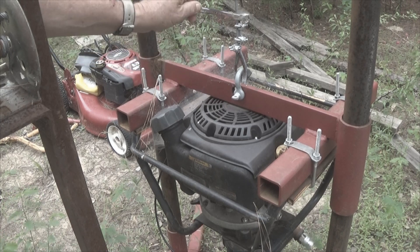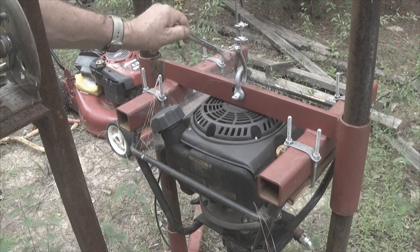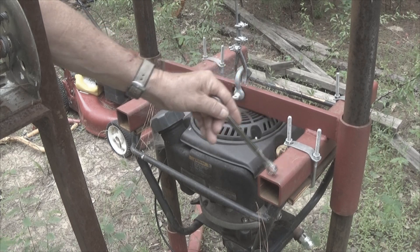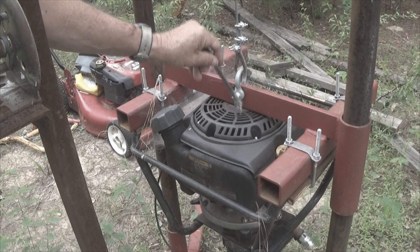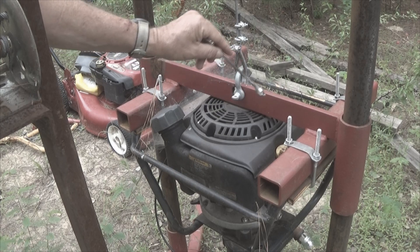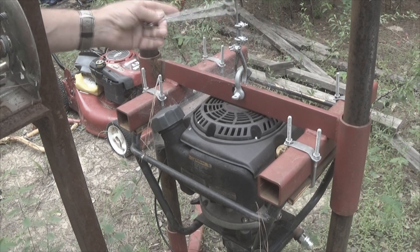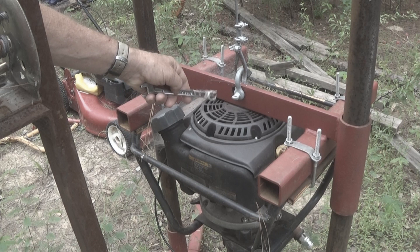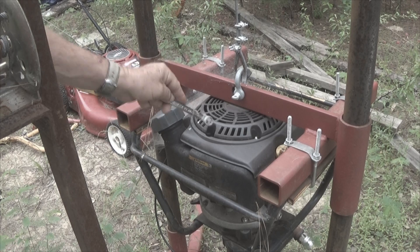This piece right here is the lift, and that's not exactly how that should go, but that's okay. I did have to adjust this motor a couple of times to get it centered again. The guys at the shop had it exactly on the money so it was right in the center of the hole. But I had to move this and I also put some square tubing in here to help hold it in place. I'm assuming when they rig this thing up they have a jig to get it exactly right. I didn't have that option, so I put some small square tubes in right here and on the other side to square that thing up.